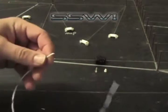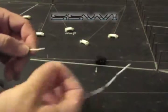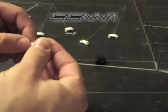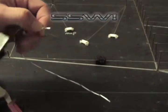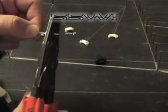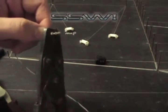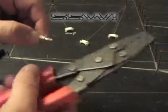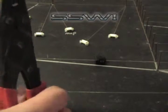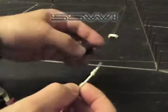Go ahead and grab the wire and strip off about an eighth of an inch of insulation. Place your seal on the wire and your terminal. Crimp down on E, and then go C and D with the crimp tool die. Go ahead and double check this one — give it a nice firm tug, a five pound pull test.